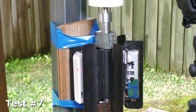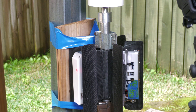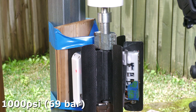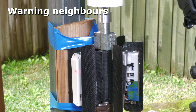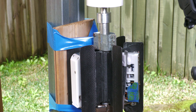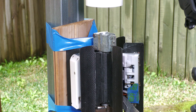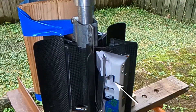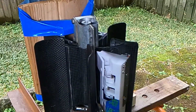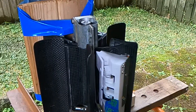After we got it back, we set up again to test the other servo to see if it would also release at this pressure. We pressurised to 950 then 1000 PSI and released on the countdown. Now let's see that in slow motion — here the cam starts moving and releases. That test was also successful.